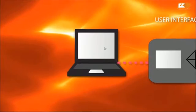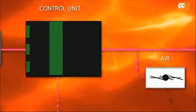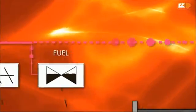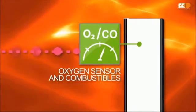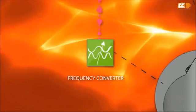Site personnel monitor system operations on a computer screen. The control panel is the user interface for the system. The control unit operates the burner. The servo motors operate and control air flow, fuel flow, and auxiliary damper. The bus cable transmits information between system units and to and from the control panel. The optional oxygen sensor or CO sensor observes the residual oxygen levels and increases the efficiency. The optional frequency converter adjusts the fan motor rotation speed.